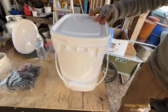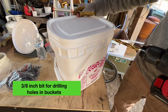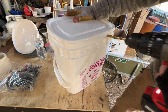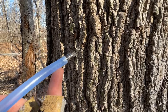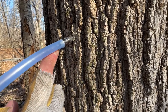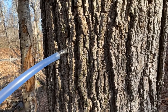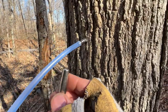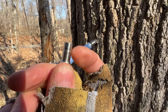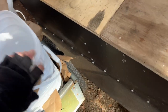Getting your buckets set up for tubing is very easy. Leave the lid on so you know where it overlaps on top, then put your holes wherever you want. If it's a big bucket you can put two holes for two tubes for a double-tap tree, or do singles. Give them a quick wipe out after and you're good to go. The plastic buckets use spiles with a little barb at the end that holds the tubing. These stainless steel ones are a bit expensive up front, but you clean them up, give them a good boil, and you can use them for years. The barb right here is what holds the tubing on once you get it over.